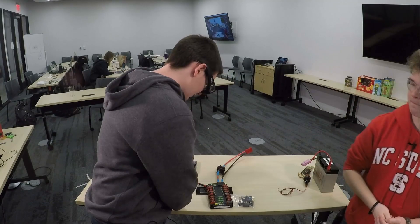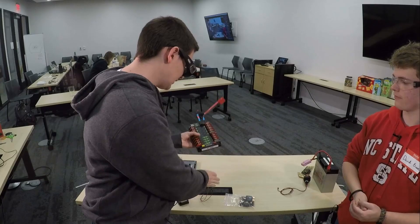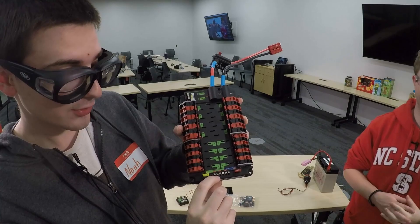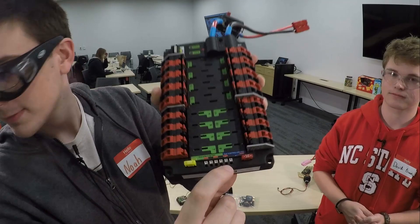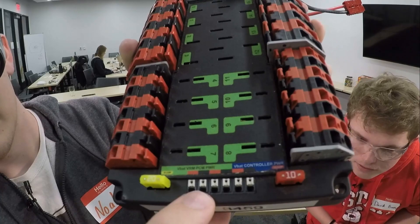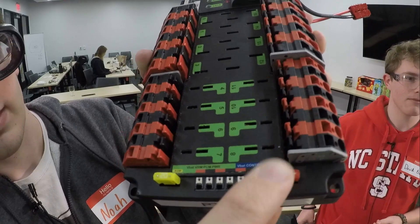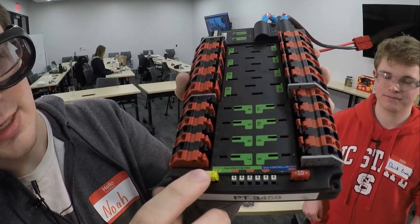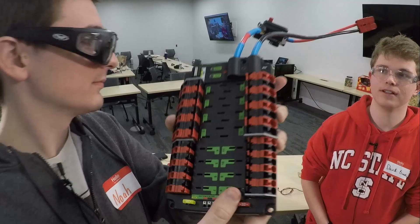These wires are going to go into the 20-amp fused VBAT VRM PCM power spots. You don't want to place it in the VBAT controller power side — you want to put it in one of these under the green bar and not one under the blue bar, because this side is designated for power and this side is designated for the roboRIO. Also ensure that your fuses are in here — there should be a 20-amp fuse on this side and a 10-amp fuse on this side. If they're not in there or not seated properly, the devices in these ports won't turn on.